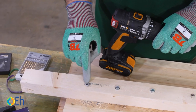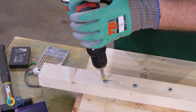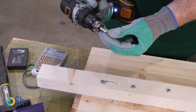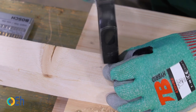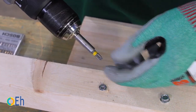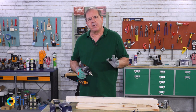First traditional solution for removing screws. In this case it is a torx screw. This is a test we can do — we have here a drive that is T30 and, as you see, does not rotate. We can't remove it with the corresponding bit. What we're going to do is use a torx of the following number, a T40, and see if we're able to stuff it a little so it takes the shape of this screw head. Well, this remedy slips and what it does is make it even worse. I have used this procedure with Allen bit screws and it is easier because they have more solid grooves. These are smaller grooves that hook the torx and, once we've broken them, it is practically impossible to recover them.